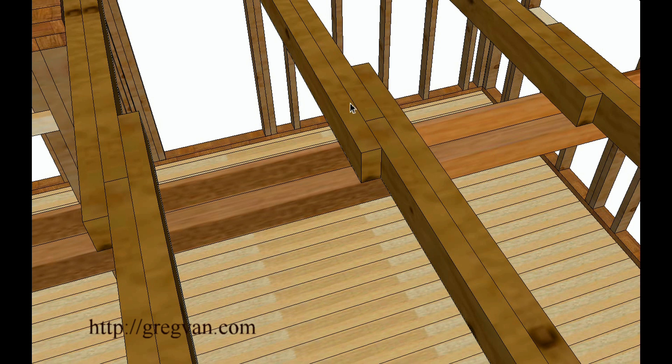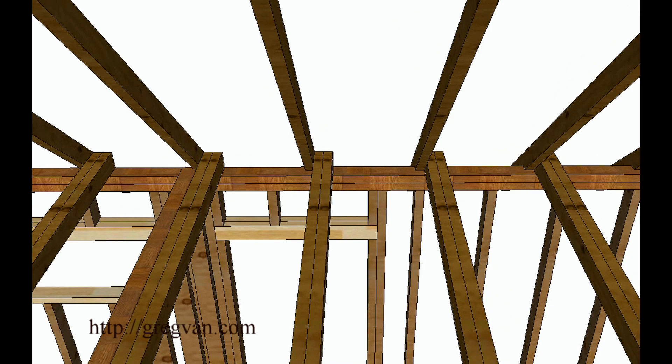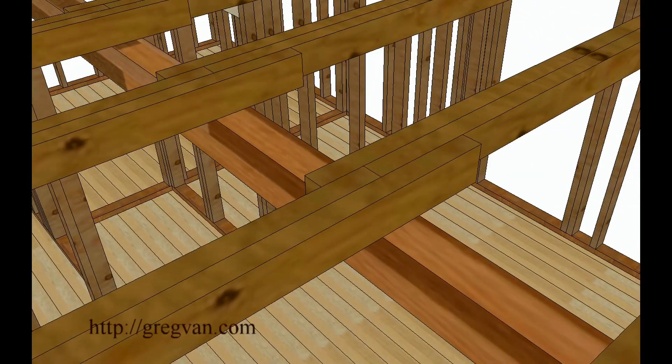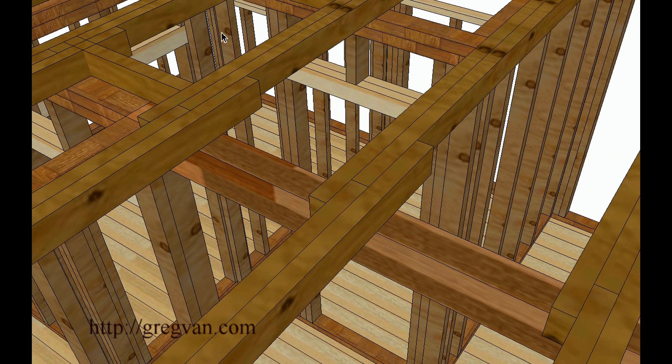You would need to cut one of the joists because it would be running through in order to be able to nail the sister joist next to it. Put some thought into this — don't just jump into it. Try and figure out what's going to work and what isn't going to work, and which method I'm providing you with will work the best.